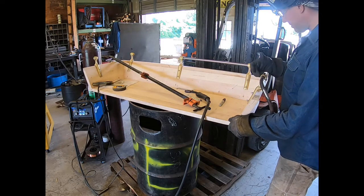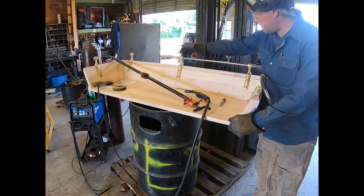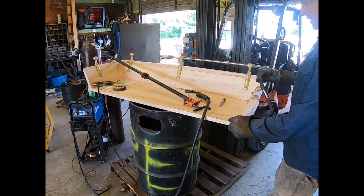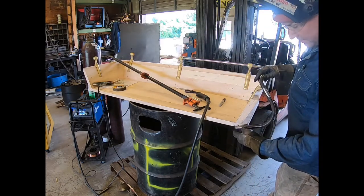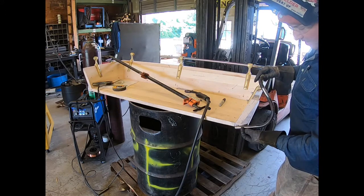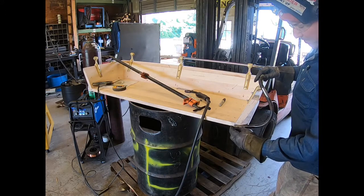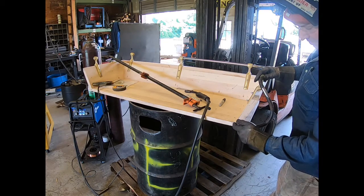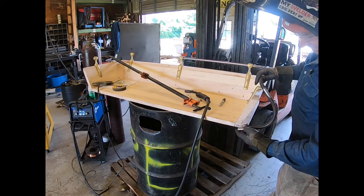But like I said, we got set screws here, here, and then we got 2 here. And what we have to do is actually mark this and cut it, and the other piece will join in the center. But what I want to do is get this exactly where I want it. This will, like I say, get cut off. We'll take a piece of flat bar and put on here about maybe 1.5 inches long. Have a hole drilled in it. There'll be a screw going directly where that arrow is.